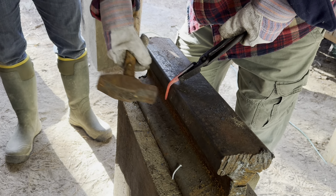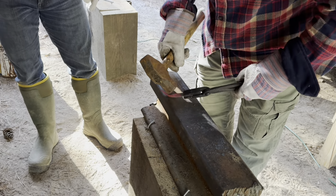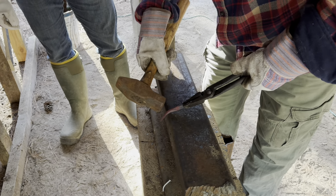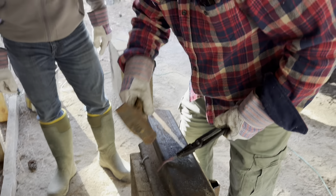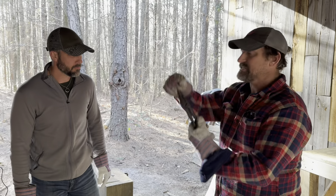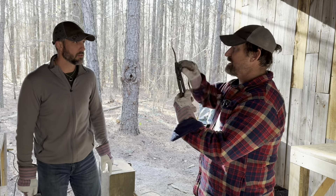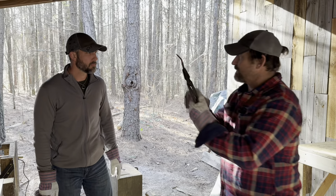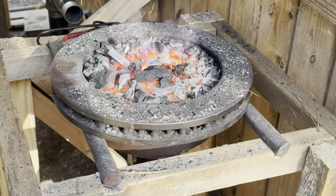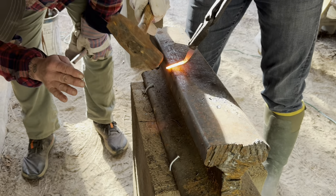We're going to curve it down and roll it all the way around. I'm going to come back a little bit and then bring that down - that way I start to build the curl. If I just hit here it's going to be a 90-degree angle, so basically you break it here, break it here to make a circle - not just way on the end.